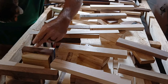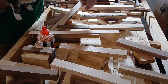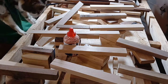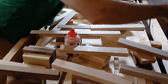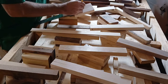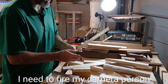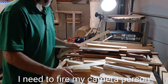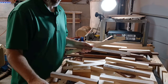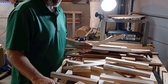So right now I've got one, two, three, four, five, six, seven, eight, nine, ten, eleven mallets that I can make. I'm going to make these dead-blow mallets — two pieces here marked out that I need to cut. I'm going to glue them to the handles to make those wider, and I've got everything marked — the center pieces marked in half so I know where to drill the holes.